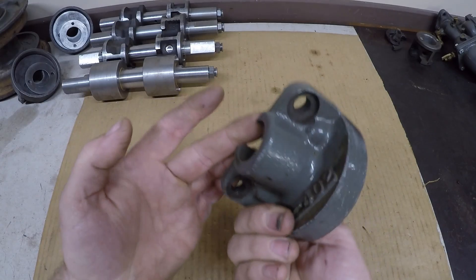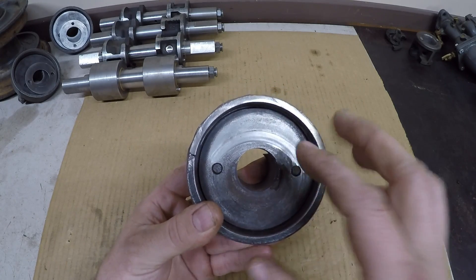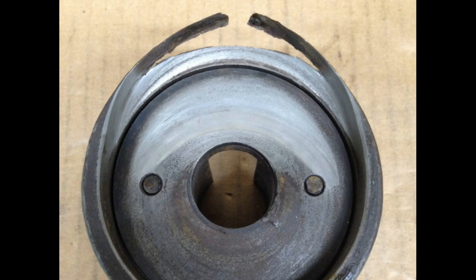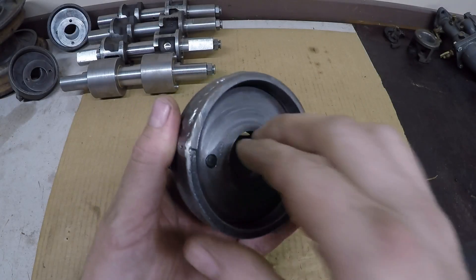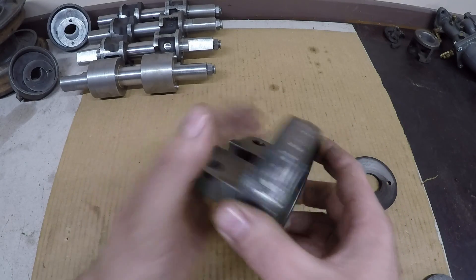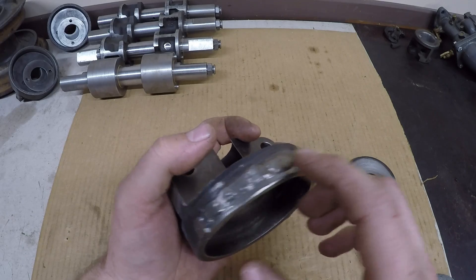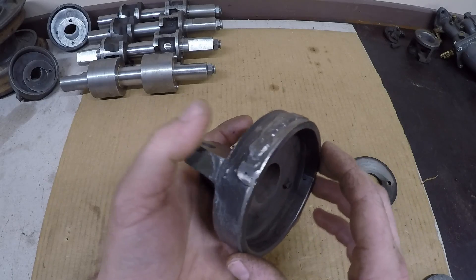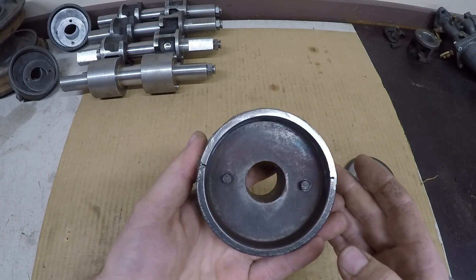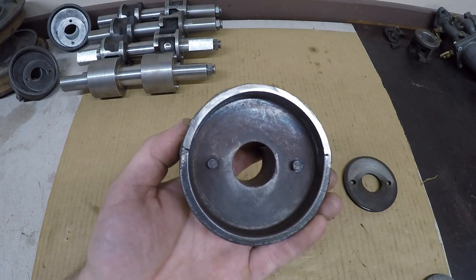One last repair: this bearing cap was adjacent to that completely collapsed bushing. Because the roller had no support, it wore heavily into the thrust washer on the top side, and the hub of the roller also wore completely through the bearing cap in the upper section. To repair that, I cut out the thin portions of the cap and welded in a new piece of steel. It was a difficult weld because the cap appears to be cast steel and the patch is mild steel, so I had to stitch weld it a little bit at a time and work the heat carefully to keep it from cracking. I left the weld proud rather than grinding it flush, to leave more material holding the piece in.